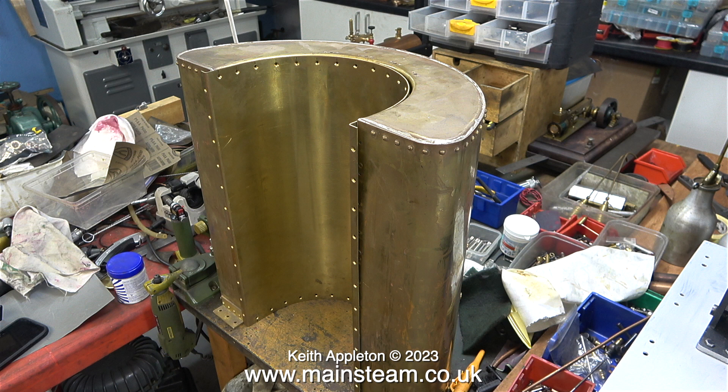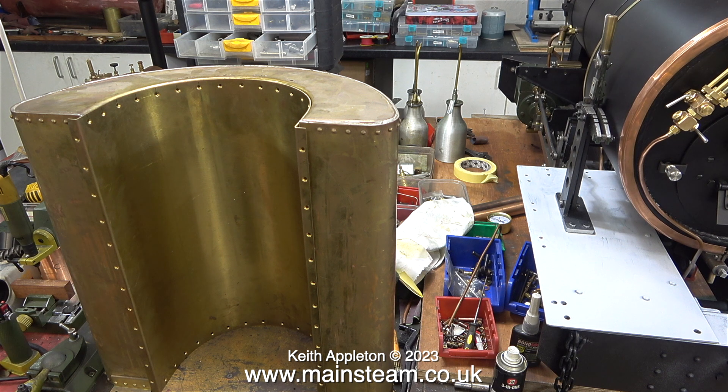In this clip you can see the construction of the tank — it's very well made indeed. The outer part of the tank, including the front, rear, and the outer wrapper, are riveted and soft soldered together, and then there's a special part that sits in the middle. This tank is perfect for the job, but it's not finished — I need to fit some mounting brackets at the front to mount onto the existing mountings which supported the front of the really ugly side tanks that were fitted.